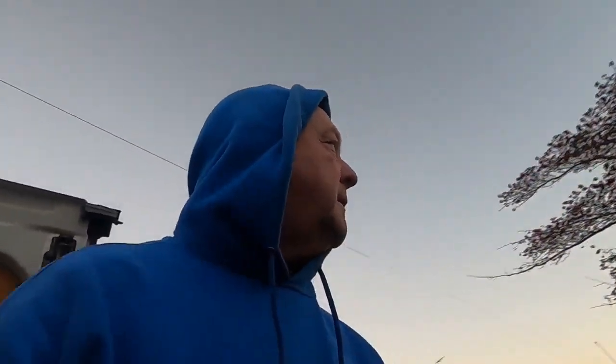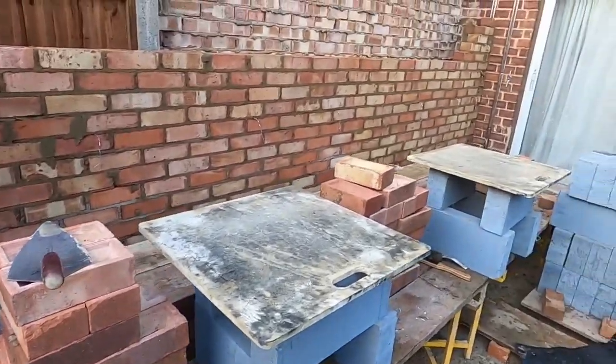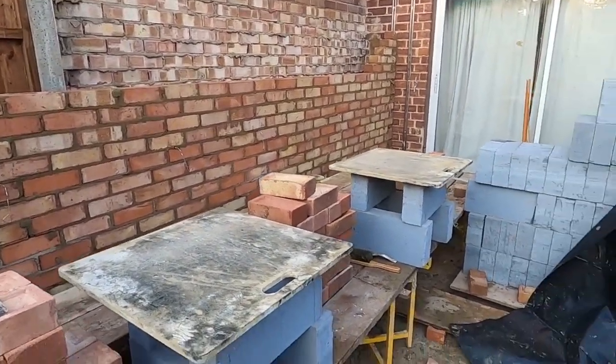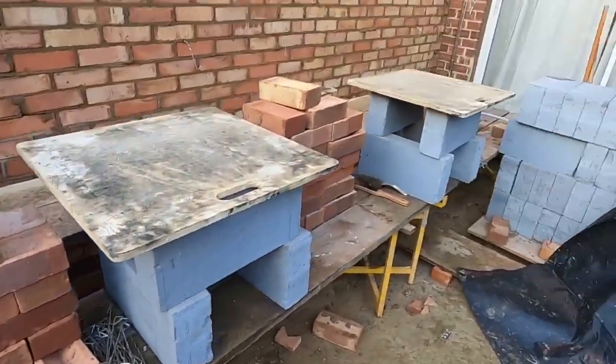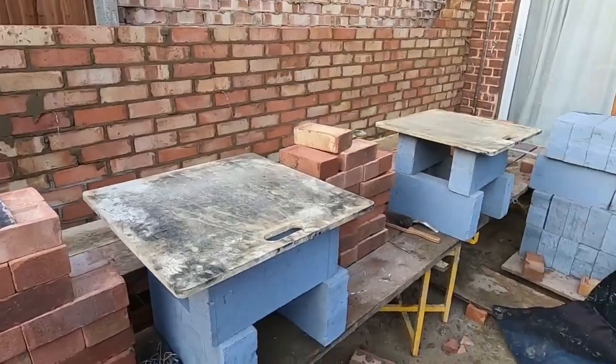Let's get the boots on. Melvin ain't here yet but we'll make a start. Today's setup — I'm just going to finish this off. I normally only go about 15 courses with this overhand work, and then we put bandstands up. But we're having the whole thing scaffolded, so we've got this hop-up here to get us up to 21 courses all the way around, so it's all right for the scaffolder.